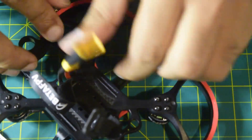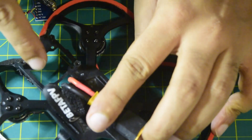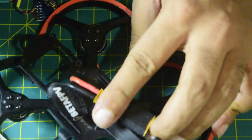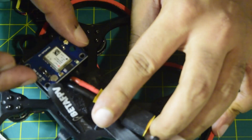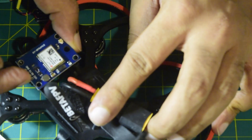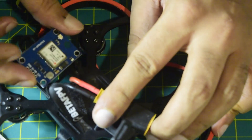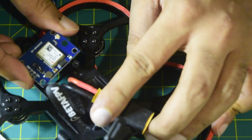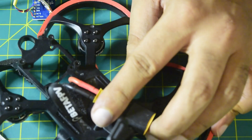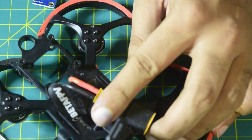Since this is a CineWhoop drone frame I don't have a lot of space to install the GPS, so on the back side on the top cover I've installed standoffs for M2 screws to mount the GPS module right on top. You can see when I place the GPS module on top of the standoffs, there's enough height to have the antenna connected as well with no problem. That's how I'm going to install it on the drone frame — this is the high-level overview of the connection and installation process.